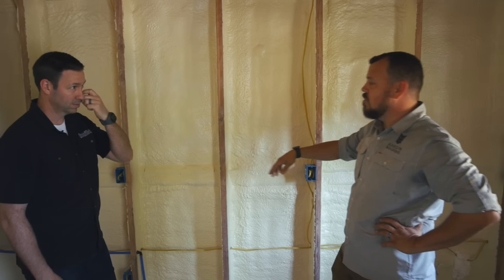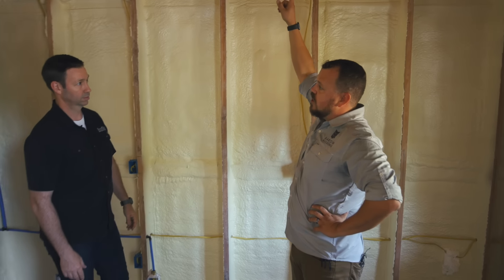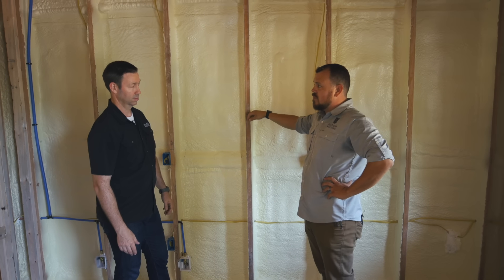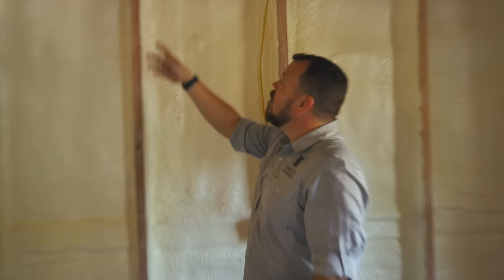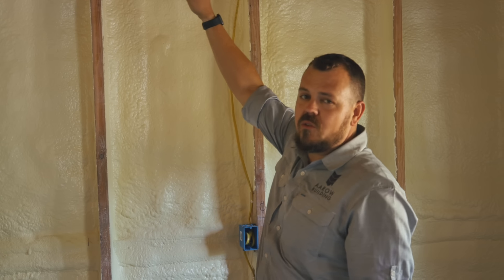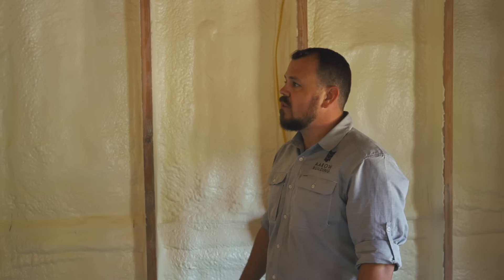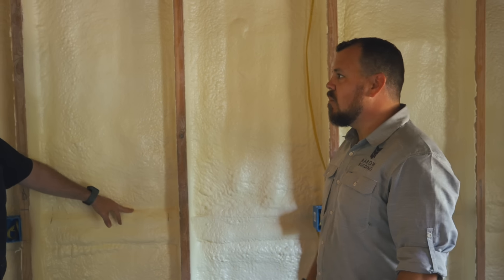In this house it's two floors — stud, floor truss, stud, roof truss. The layout is the same upstairs as it is down here. You've got to pull the layout, so why not just make it match? We aren't killing one of the top plates — we're still doing a double top plate. The framers are more comfortable with that, so we're not going to fight them over it. No big deal. But the compressive strength of this is a lot more than a 2x4.